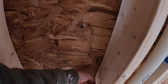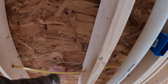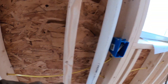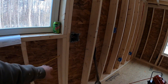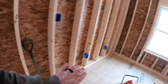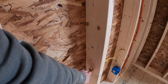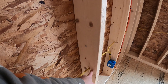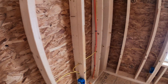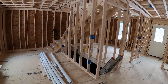With fiberglass insulation you can actually pull wire up through the staple if you need to later. Every now and then you'll see a nail that missed the stud — it's worth pulling or bending it over if it's anywhere near your wire. You also need to check code on clearance from the surface: I believe it's one and a quarter inches. If you're closer than that, you need to put a nail plate on so nobody drives a screw into that wire. With two-by-six walls we're in good shape.